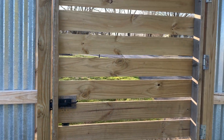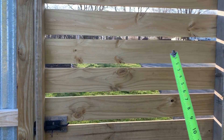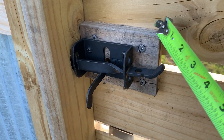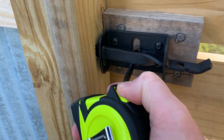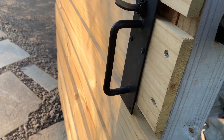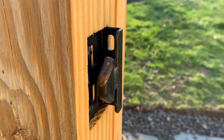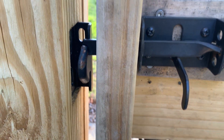You can't see any lines. I made it with the idea that worst case scenario I'd put one of those cable turnbuckles down to hold it, which I have not needed — and I'm so thankful. So you can see right through it. For the hardware I used just one of these old latch things. I needed to do a block of wood to get this into the center of my two-by, space it out, and then just notch the hole through. Screwed it right to the boards, right through the middle of the boards — it worked out perfectly. I actually notched out the wood to recess that plate in, so when I close it I get the right depth.